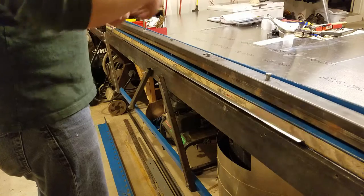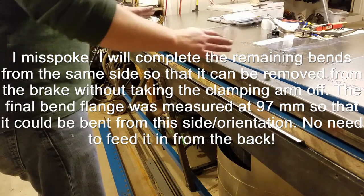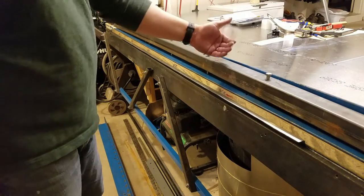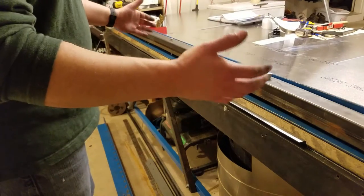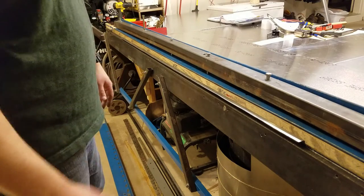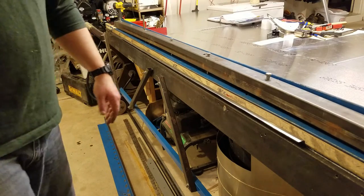I'm going to pull the final middle bend out, which is a 90 degree bend. Once that's done I'll flip this around, insert it from the back, bend the final flange over, and then what I'll have to do — because I can't bend far enough with this brake — is take a board or a straight edge and kind of finish off the last bit of it to close the gap a little bit. So we'll come back here in just a minute.